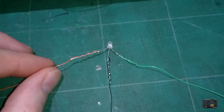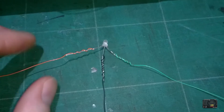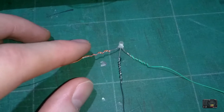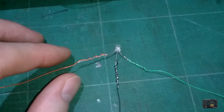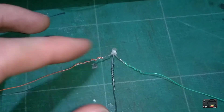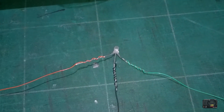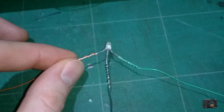Okay guys, so the first thing you want to do is prep your LED. Just get your wires around the legs and get the right colors sorted - I've used orange for the red and green for the green color obviously, and then I've got black on the center leg for the ground. You can solder them to the legs, but I think winding them around the legs just makes it a little bit more sturdy. I'm going to wrap some insulation tape around each leg just to keep it all nice and compact so nothing unwinds, whether putting this mod together or in the future when you might want to take your case to pieces.